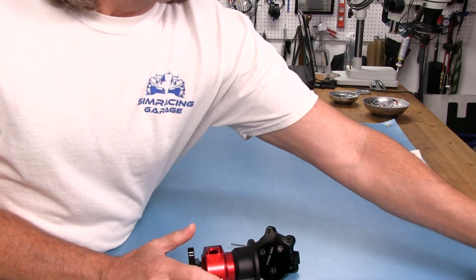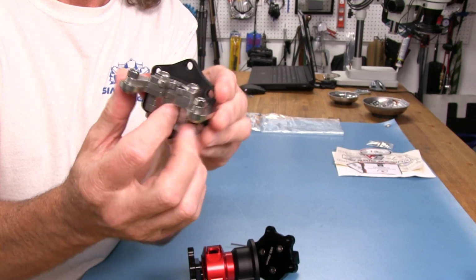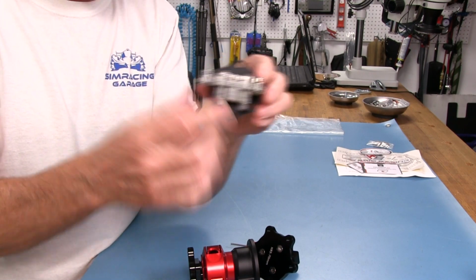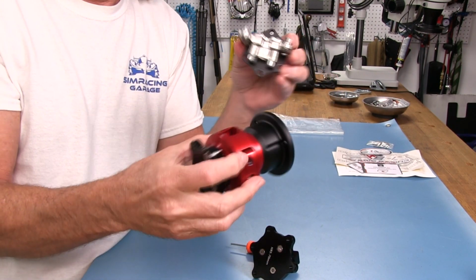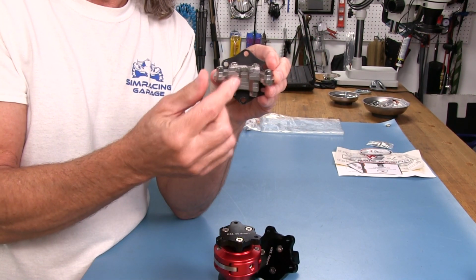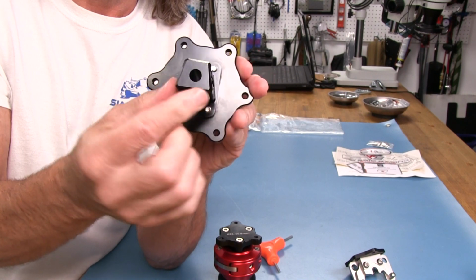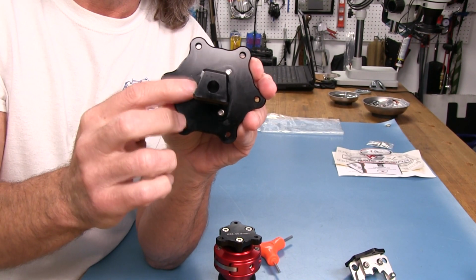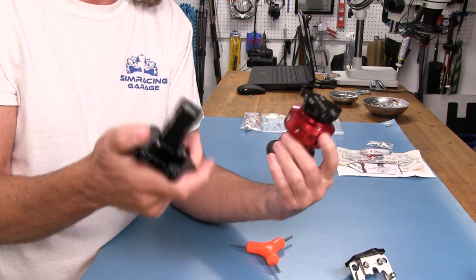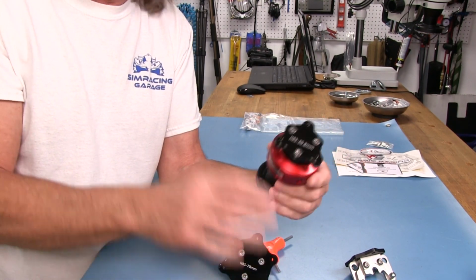And that is this system, the tolerances, because of this stack here, right, on these Q1Rs, the tolerances aren't as tight, and that probably can't be as tight, I imagine, as they can be with a single piece like this that's being pressed into a pocket, if you will, right? So the tolerances aren't quite the same because of the construction here. I mean, we can CNC these to the thousandths of a millimeter, I'm sure, with the right machinery. So the tolerances are going to be tighter here, and that's going to make it so you can switch all your different wheels. You have 2, 3, 4, 5 wheels, whatever you have. You should be able to, I'm assuming, do this without having to make any adjustments.